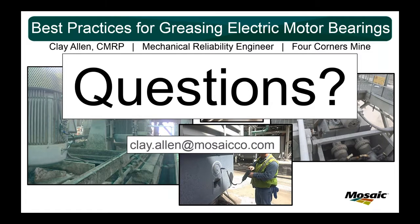We do our motors on a 3 month frequency, and in some cases, in some modes, we could get away with a 6. That's why I have a lot of zeros on my 3 month. Then maybe in the next 3 months I might have to add a little bit, but it all depends on your frequency. Just speaking from us using Shell products, I know Shell has something called the Tactic Auto Single Point Lubricator. SKF has some too, and I've looked at those as well. But it just all depends on your frequency, right?